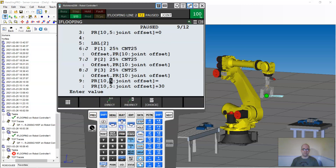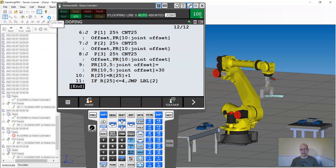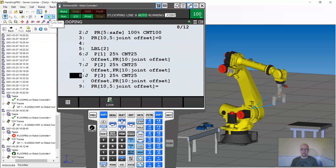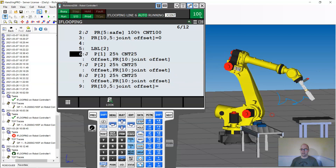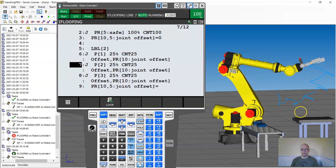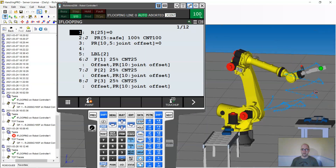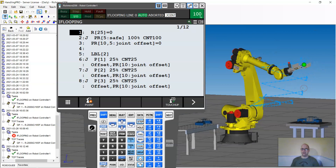At the end of my job I use a math command. Since I'm using joint representation, it's going to be in degrees. I'm going to offset the angle of joint five, adding 30 degrees each time, and use a register to keep count. This will run four times — when the count is less than or equal to four, it jumps back to the label. You can see it sloping up as expected when offsetting by a joint register: one, two, three, four positions. Done.